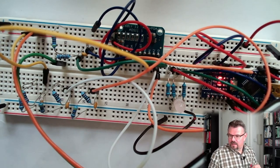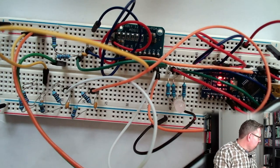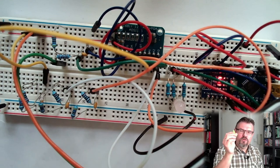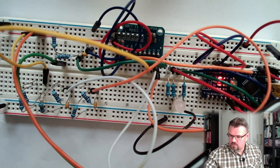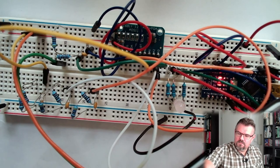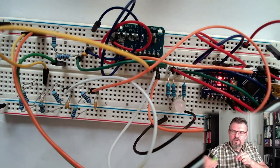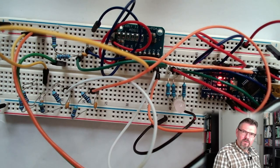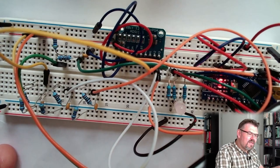I also use clamps here. All right, so what I'm going to do: it's nickel metal hydride, so we should not go below 1 volt. And 2 in a row, because I'm going to use such a carrier with 2 batteries inside. So we have 2 times the voltage, and we should not go below 2 volts. This 2 volts is 0%, and 1.25 volt is maximum, so 2.5 volt is 100%. And I want to see what values this ADC is giving me for those.